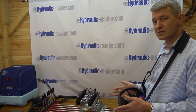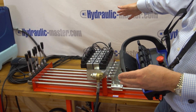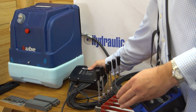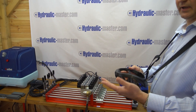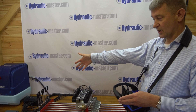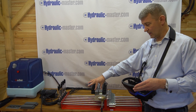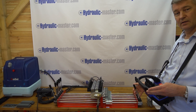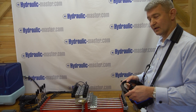We strongly recommend the SC400. People always ask us: is it difficult to connect? I can answer that in one word — no. You literally just attach these 12 points here; they go through to the control, which is of course a radio remote control. Standing back, I can be up to two or three hundred meters away, operating this. It sends a signal to the central controller, which operates the system via these solenoids, exactly the same as if you were in the machine itself using the levers.